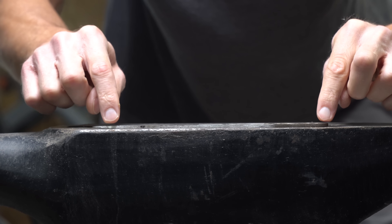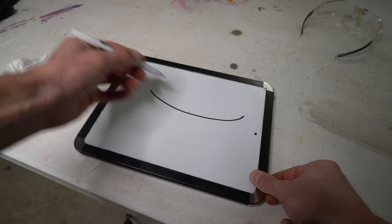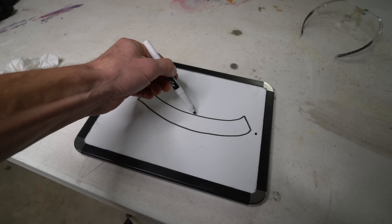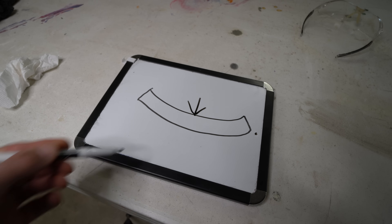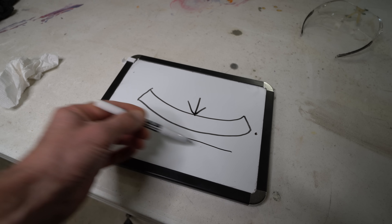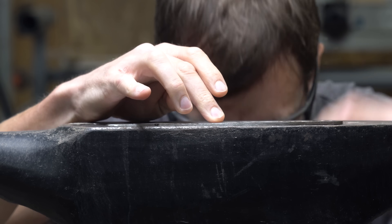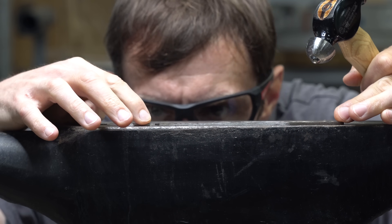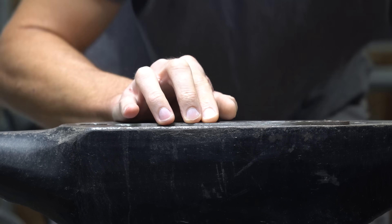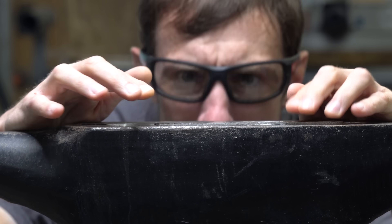So now it's time for the first test. I just want to show you exactly what we're doing — I'm going to exaggerate a lot here. If your knife is bent this way, you're going to want to hammer on this side, and that'll actually stretch this side of the material to straighten it out. It's really that simple. Our first blade is a piece of A2 tool steel with a slight warp in it, and you can see all I'm doing is hammering back and forth, finding exactly where the blade is bent, then hammering on the opposite side to straighten it out.